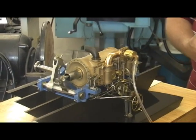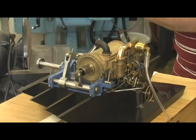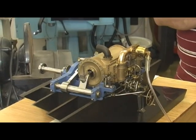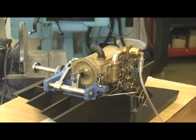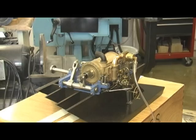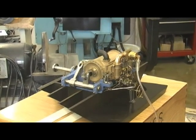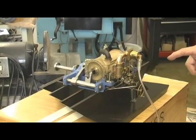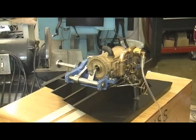It was moving a 980-ton ship and they didn't have a lot of extra power available, so they had to keep the engine tuned as efficiently as possible. That's why there are recording instrumentation pipes on the engine — you don't find that on a regular steam engine. When they go to record an engine they always add the pipes, they never leave it on the engine.